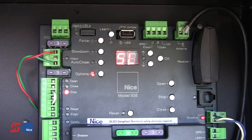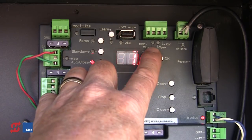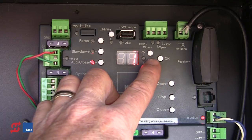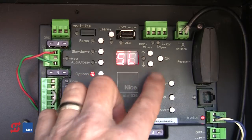The next one is SL for Solenoid Lock. On the lower right side of the board, just below the alarm output, there's an output for a solenoid lock. If we have a solenoid lock, we turn that lock output on by selecting option 1. This turns the lock output on to activate the lock on the opening cycle, and also puts about a one-second delay on the operator so the lock can release before the gate moves. The default for this selection is off.